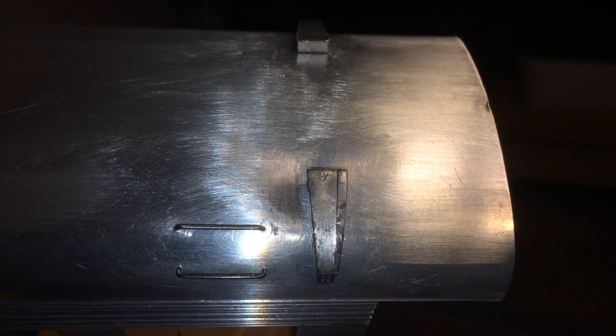What you do is keep moving back over these areas with a thousand grit piece of sandpaper after you've removed the major stuff. There's another one — a piece we didn't get from the other pass. Sooner or later we're left with a surface that's scratched, but now it's just tiny scratches, and we're going to go over those with higher grades of sandpaper. Once again, this 800 grit is just to get the big stuff.